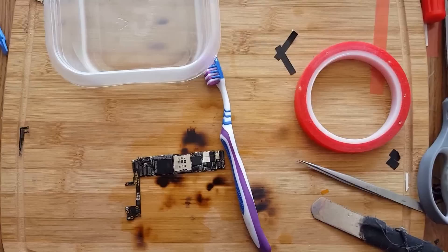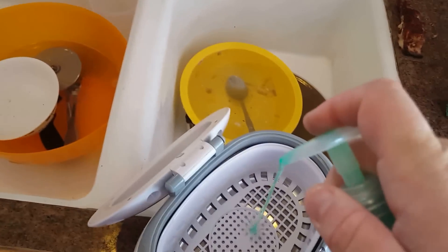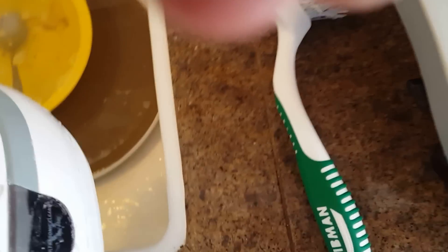Now for the ultrasonic bath — after we scrub it really good, we'll place it in our unit right here. We're going to take our old ultrasonic bath liquid and properly clean it out. Just pour the old stuff in the sink. Do not rinse it at all with sink water — that would be bad. Take distilled water and pour some in here, then take some soap. Good detergent soap works really well. Scrub it with a sponge and get it all nice and bubbly in there. Soap will never hurt the board, but we're going to try to get that all cleaned out really well.